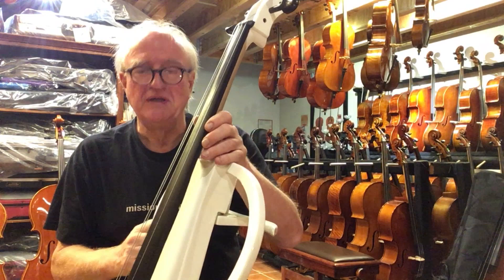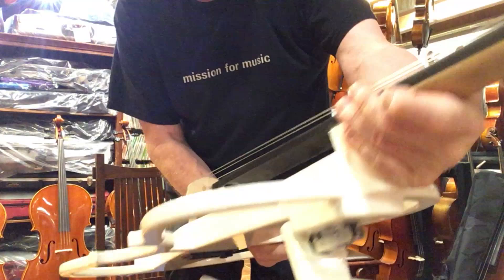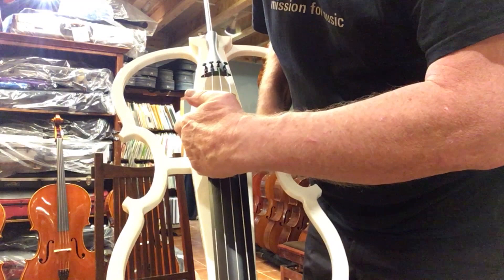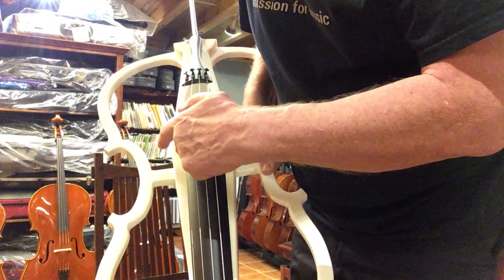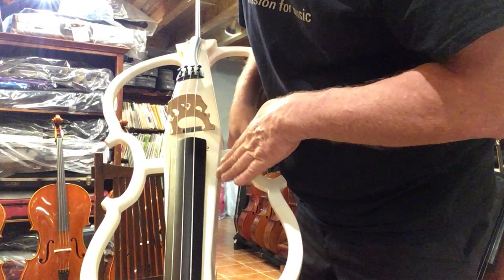The other thing is that although the bridge is put in the right place just on top of the pickup sensor, the fingerboard is pointing quite a bit to the right, which leads to the fact that the strings are too close to this side. There's a lot of space between the C-string and the edge of the fingerboard, and there's virtually no space left between the A-string and the fingerboard edge. So you can see that the fingerboard wasn't fitted well — it is pointing too low, and it goes very much to one side.